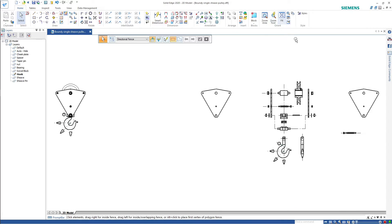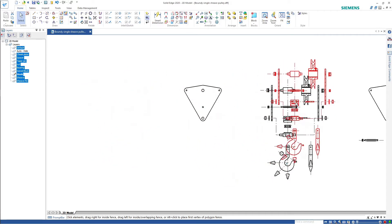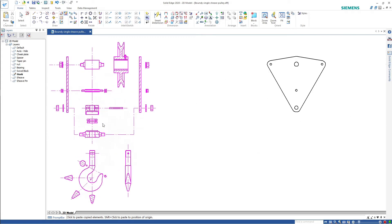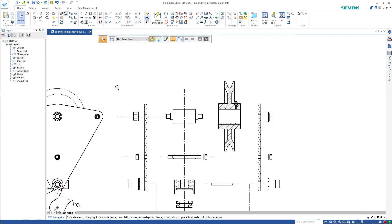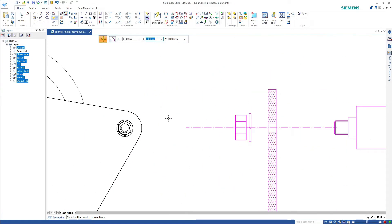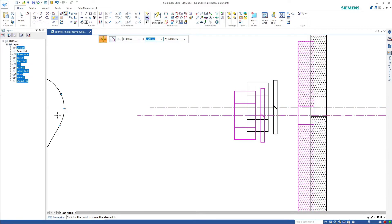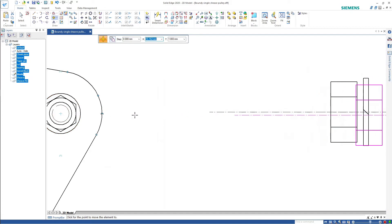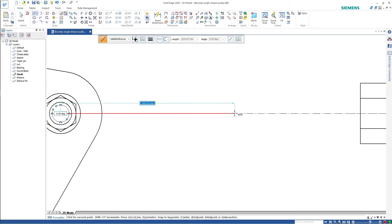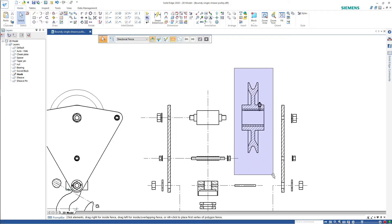Let's zoom in and look at the lot. We're doing our side elevation now, which means we cut and paste all of this, put it back where it was originally, copy it, paste it over here. Being a technical drawing, elevations have to line up, which they did. I've copied it across and now I'm going to align the views again, aligning the center with the center of that bolt hole.